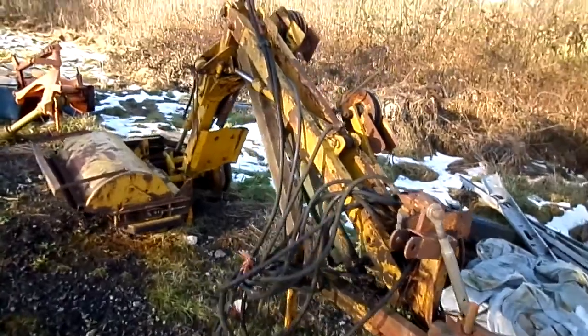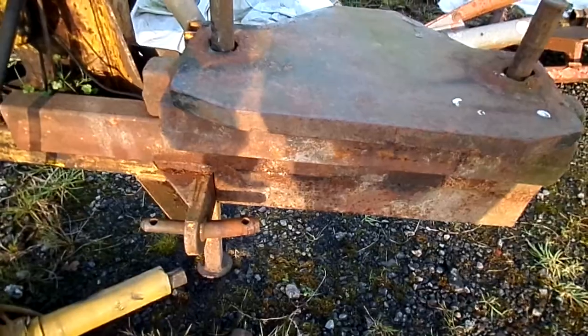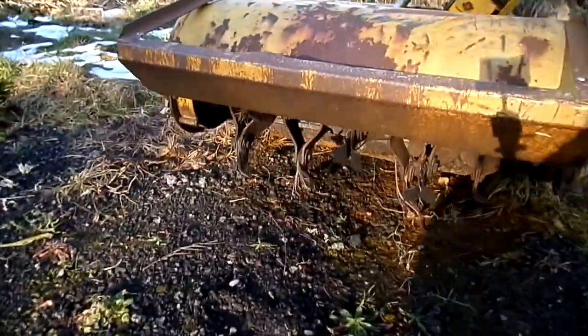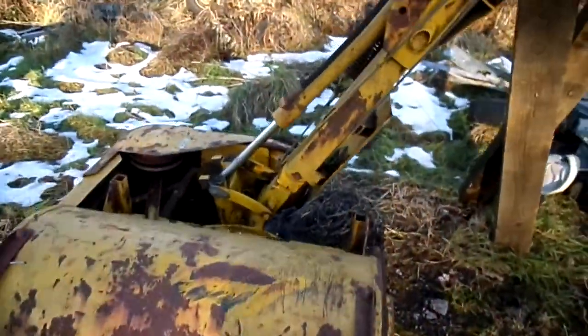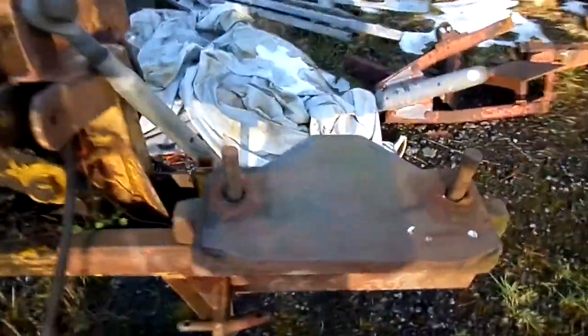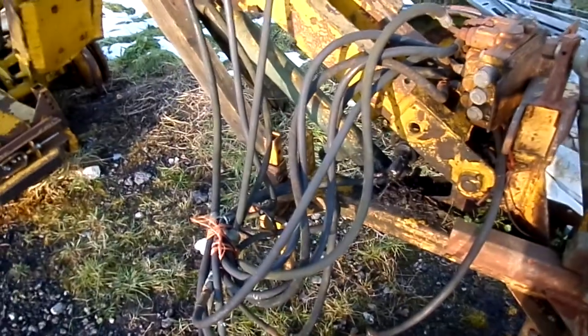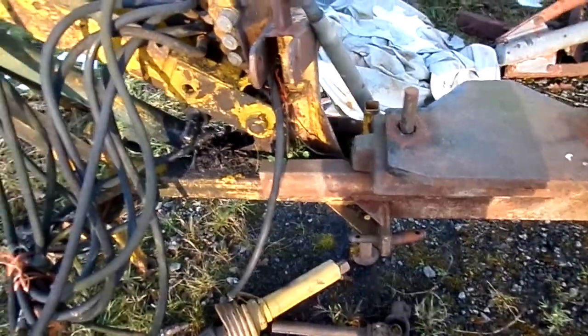Old Teagle Dinacut 400, belt driven. I just put this weight on this side now because the tractor was very unstable — when you lift that out there's a heavy head on there, heavy flails. And the stuff this cuts is unbelievable. We've had this for years, it's been brilliant. We do all our edges with it. One ram was changed there and I've got to sort that out, put some bushing in here. But I put that weight on because when you were leaning it over, all the weight was coming off the inside wheel of the tractor and it started spinning. So it balanced it out a bit better. And put more weights on as well.